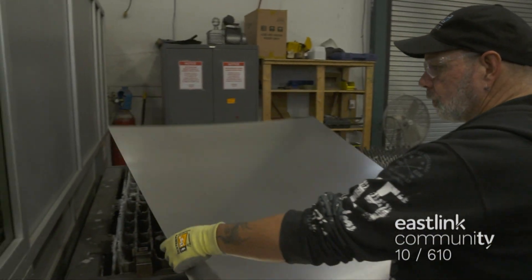Many cases require labeling for switches, dials, or meters. There are four different ways the enclosures can be printed at Protocase, depending upon the requirements. Direct digital printing is being used on this part. First, the printing technician sets up the file in the digital printer software. The printer then moves quickly back and forth across the part, printing the ink in layers. Direct digital printing can print virtually any color, including gradient finishes and CGI effects. The ink cures instantly with ultraviolet light and requires no additional drying time.